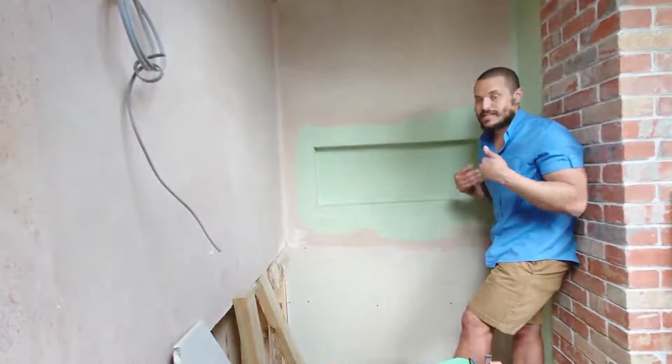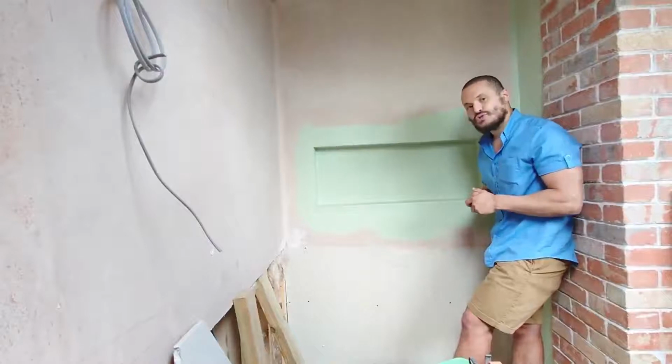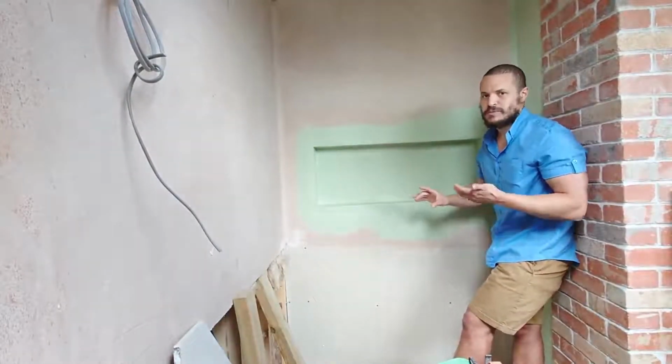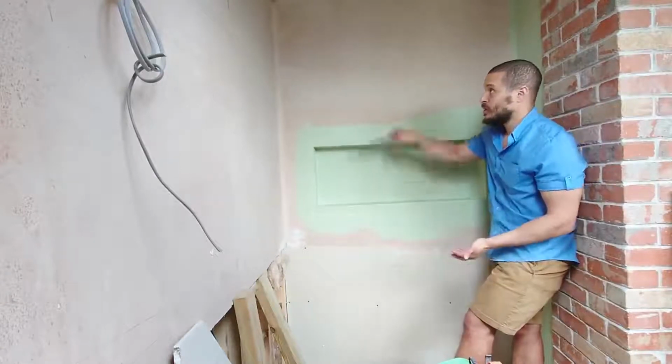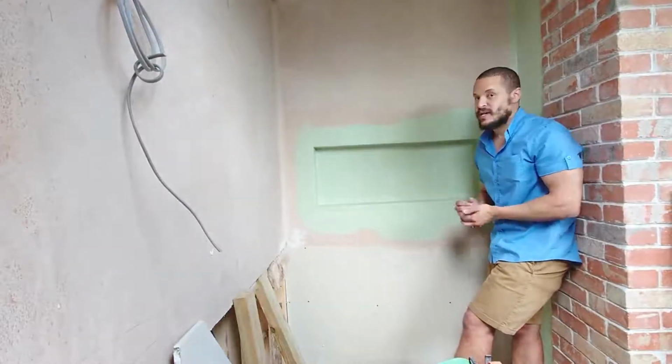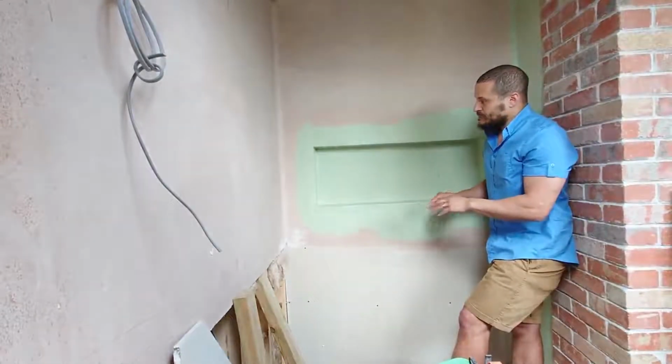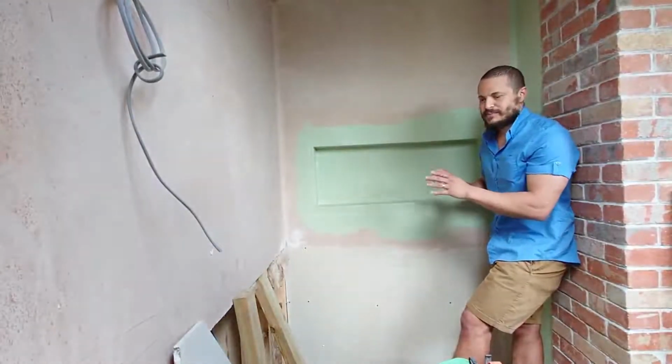The only downside is the plasterboard I've added in wasn't a moisture resistant one. However, the premise of me adding in this waterproof layer at this point should mitigate against that, because ultimately that product could have been put all over these normal plasterboards and then I would have been fine from a waterproofing point of view.